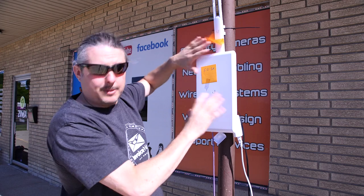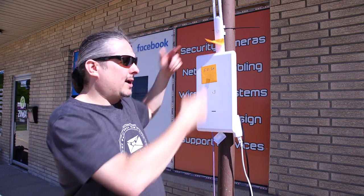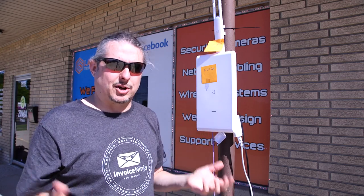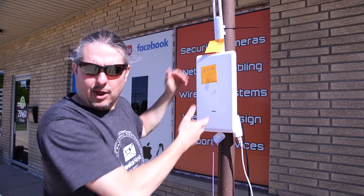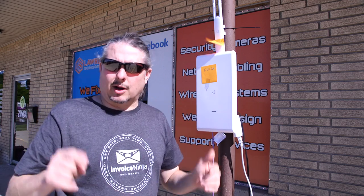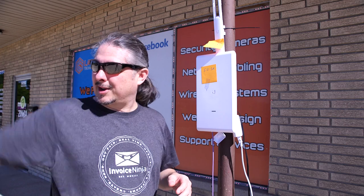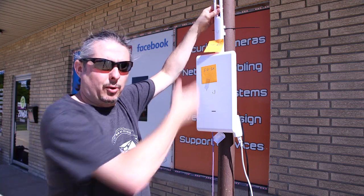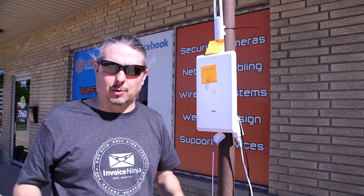We put them at roughly the same position, but we're not turning them on at the same time because if you had them both on simultaneously you create a different issue — they'd kind of fight with each other. When designing a wireless network, don't put two right next to each other; it's not ideal. So we're going to test them each individually: plug one in, go all the way across the street, do the test, then unplug and swap to the other.